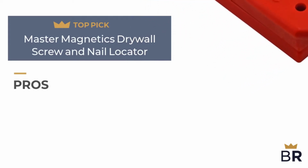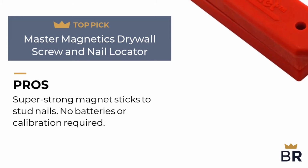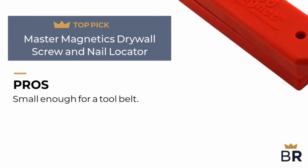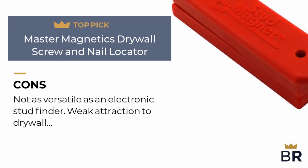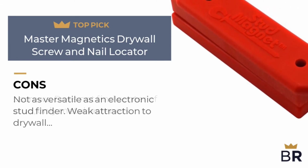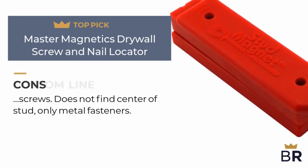Here are the pros. Super strong magnet sticks to stud nails. No batteries or calibration required. Small enough for a tool belt. Here are the cons. Not as versatile as an electronic stud finder. Weak attraction to drywall screws. Does not find center of stud, only metal fasteners.